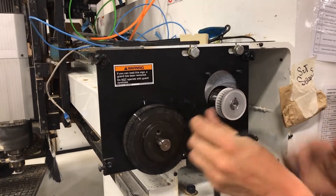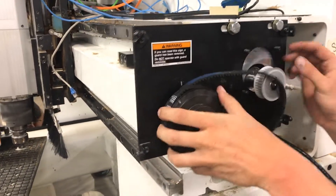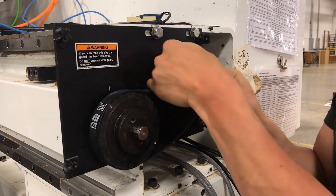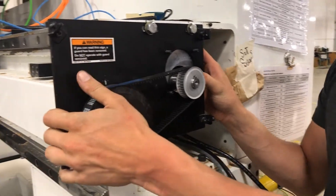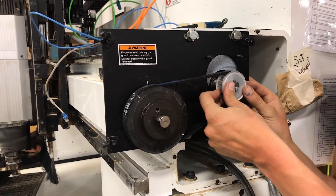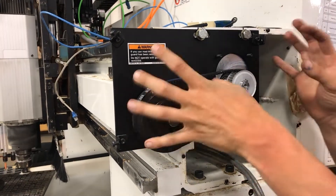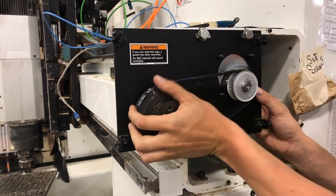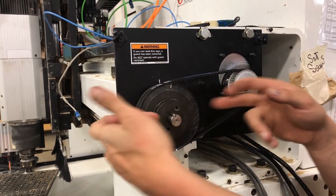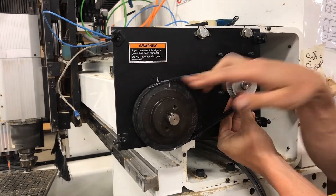Slide him on. What I like to do is put on the new belt — we'll just snug this up for visual now. We'll line it up best we can by eyeball, and then before we truly tighten everything down, we're going to run this screw back and forth for several rotations and make sure we don't have any belt walk, so when everything is lined up perfectly it's never going to rub.